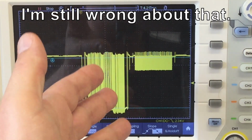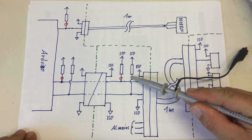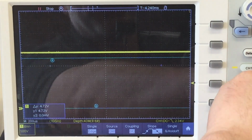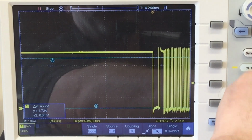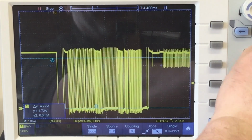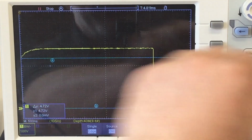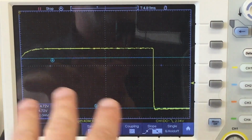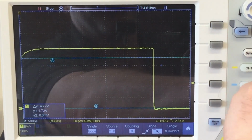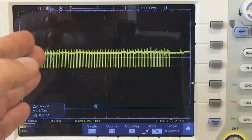Let's do the same with AC mains power. I stayed with my probe at that pull-up resistor here. AC mains power looks also good. And if I look at some really small peaks here, that group here in the middle, yeah, a little bit more noisy, but still more than good enough. And of course, there's still that stuff here in the back, and I have no idea why.